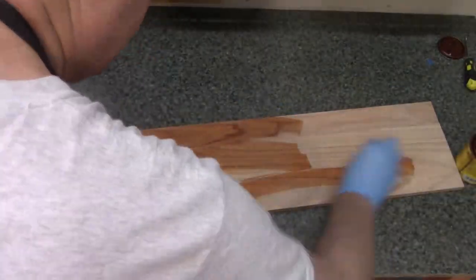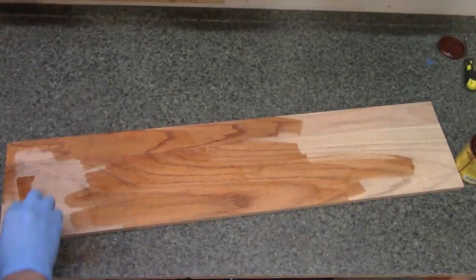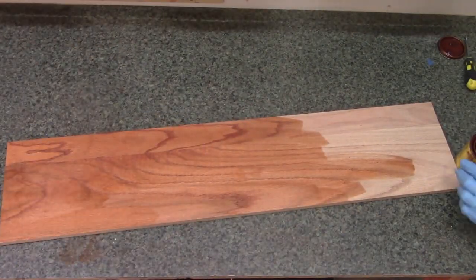The four shelves are four oak strips that are glued together edge to edge — that way we can use cheaper wood to build a wider shelf. And this time we used so many clamps we nearly emptied our clamp rack. Then the shelves are stained in polyurethane to match the rest of the bookcase — looks like one piece of wood, and that's what clamps do for you. As you can see, there are some LEDs behind me — they're pretty great, but you need a place for the sensor, so we put it here. Let's see what we did.